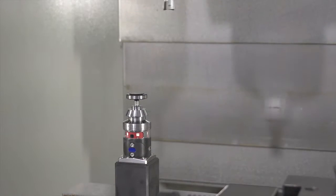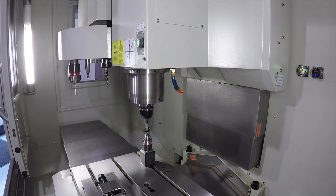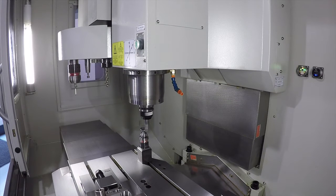So we're checking that the tool is present and not broken. You say radius — you mean the radius of the cutting tool? Yes, that's right. We can use it for full setup of the tool, so length and radius. We can also use it for checking wear, to make sure the tool is within a wear limit or that it isn't broken and is still good to cut.